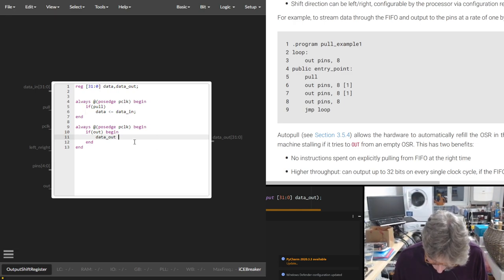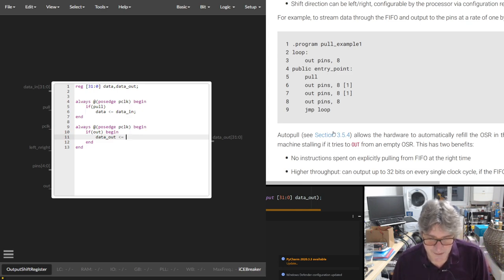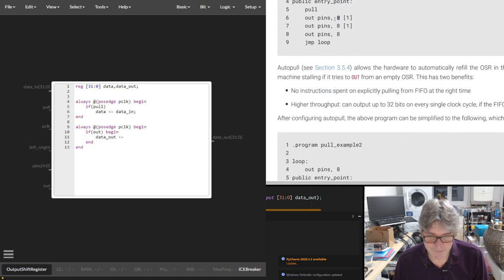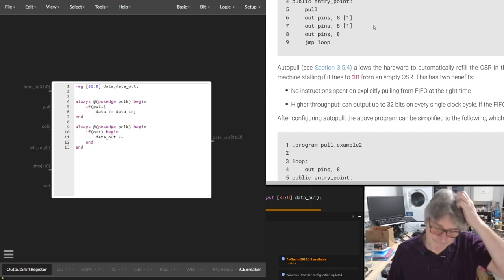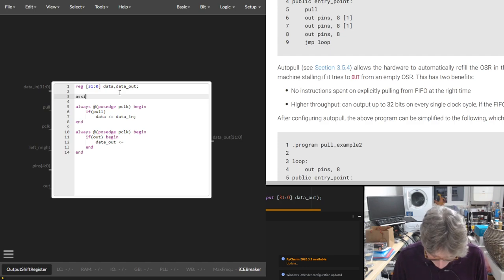So the data out, I need to assign to the data out. And what I want is the shifted bits. What's difficult here is that the number of bits that I'm taking from the data internal register is programmatically decided by one of the operands. If we look at something like this here. Yeah. So it's not like a fixed thing. So I'm going to need to do something like